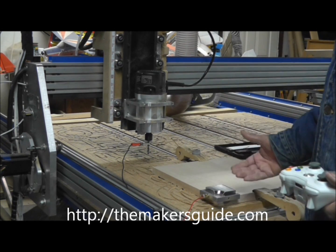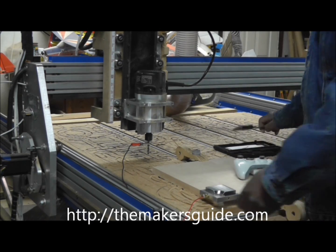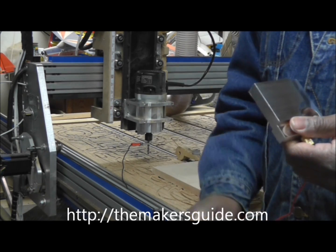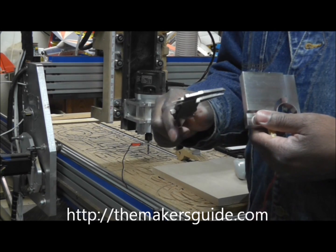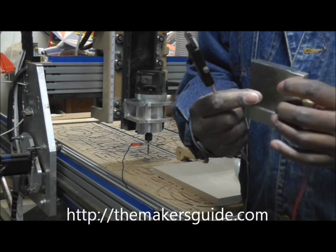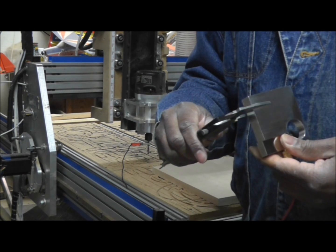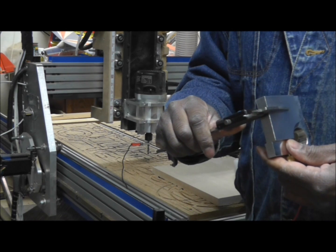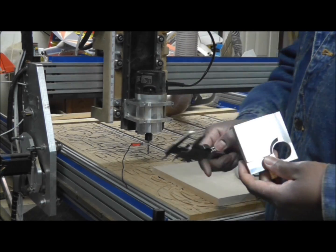Now in order to use the plate, you need to measure the plate thickness. You can use a set of calipers if you want to get a close estimate, and you measure this distance here. You can see the plate has a bottom surface and a top surface. You want to measure from the top to the bottom indentation, and in this case it's measuring somewhere around .615 inches — 615 thousandths of an inch if you're a machinist.